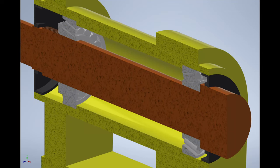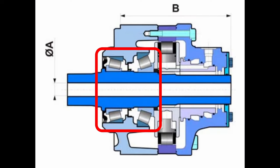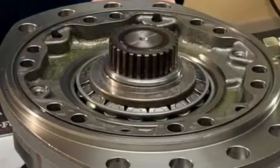These bearings do need a preload in order to remove almost all axial and radial play, providing that proper fits are maintained when machining the axle and bearing housing. I often see the same bearing setup in big hydraulic motors. When rebuilding these motors, we use a hydraulic press to apply a load and use some shims and a snap ring to achieve the desired bearing preload.